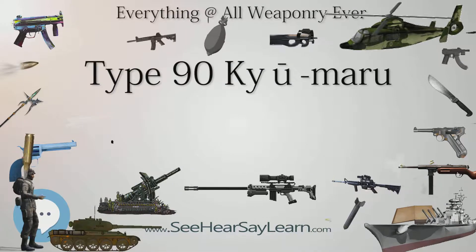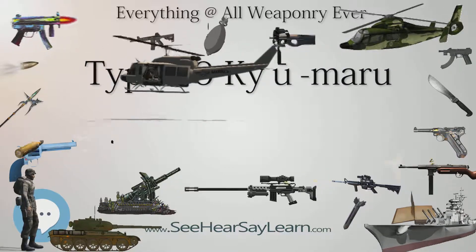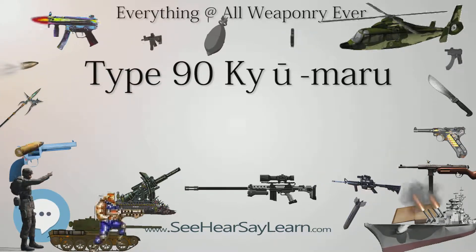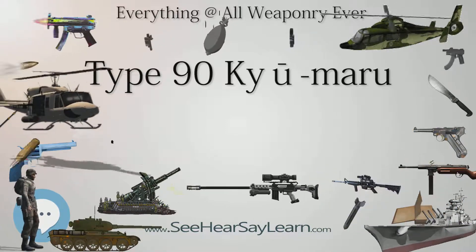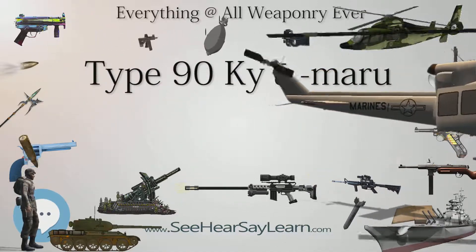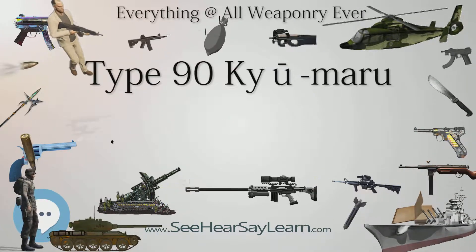The gun is armed and loaded by a mechanical bustle autoloader of the conveyor belt type, developed by Mitsubishi of Japan. As with autoloader-equipped Russian main battle tanks, the French Leclerc, and the Swedish STRV-103, the Type 90 achieves manpower savings by reducing the crew to three. Its ability to operate without a loader also allows the use of a smaller turret. The autoloader can reload in around 2 seconds, with a practical autoloading and firing cycle of around 4–6 seconds per target.